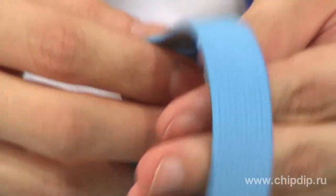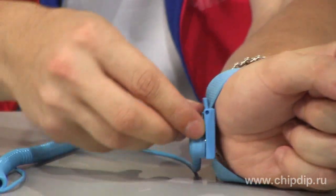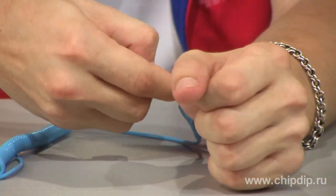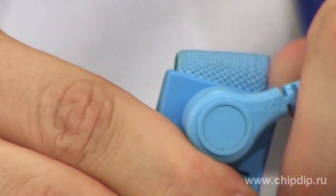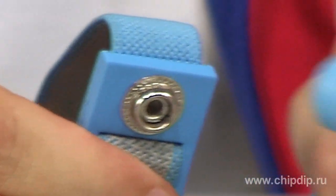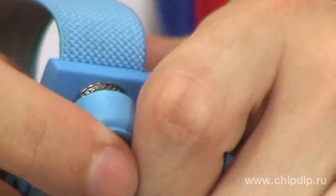Highly dense conductive fabric is woven into the strap, ensuring skin contact even under small pressure that can be controlled by changing the strap length. It should also be noted that the wrist strap has a one mega-ohm ballast resistor embedded into the contact clasp, used to provide safety if the ground bus catches electric current in an emergency.